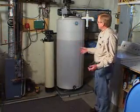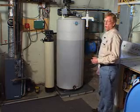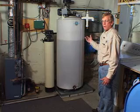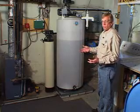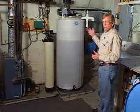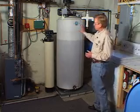The well manager is installed. Everything's up and running and we have water — quite a bit. We're up to 115 gallons already and still going. As you remember, when we started out, we didn't really know what this well yield was. As part of the setup, we did some testing and we now know that this well yield is about 18 gallons an hour. We've set the timing up with a little safety factor and we're going to collect 12 gallons an hour. That way, if a drought rolls around, we're still within a reasonable margin of error. So every half an hour, this timer is going to bring the well pump on, get six gallons of water, put it in this tank, and do that 48 times a day, unless it fills up and shuts off.